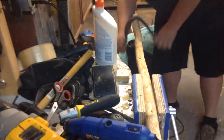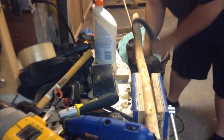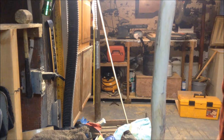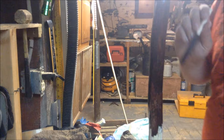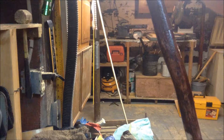Then I put the blade in and put a couple of shims into it so it would hide the blade itself. Then I moved on to the second-to-last sanding, did a little more by hand, and then put on some dark stain. It was called Red Mahogany — that's the name of the stain if you'd want to use it. I did that fairly quickly and then just let it dry.